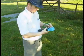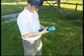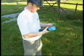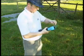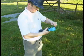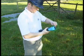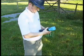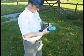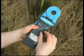The correct function of the earth ground loop tester can be verified by using the resistance testing loop. Check jaw faces are free of dust, dirt, or any foreign substance. Snap open and close the jaw a few times to ensure they mate properly.